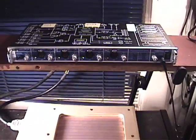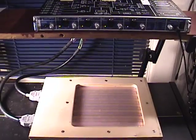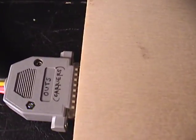In this application the interface is not used to transmit sounds that you listen to, but control signals by which the computer can calculate the displacement of the controller's surface. Eight signals are sent from the outputs of the RME here to the carrier inputs of the controller. These are terminated in the flexible copper strips just under the plastic surface here. Beneath those pieces of copper is a sheet of rubber and under that is another layer of copper strips, this time arranged in columns. Signals from the column strips go back out to the audio interface through this connector here and are amplified and sent back to the computer for processing.